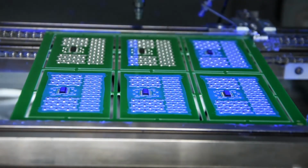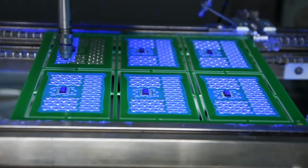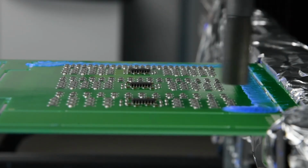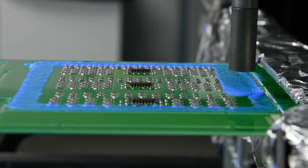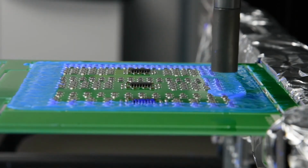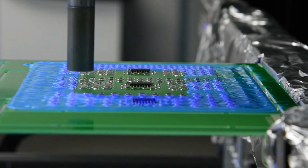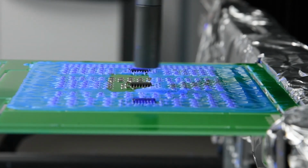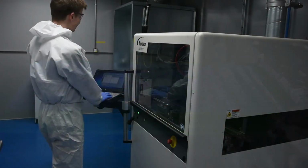The three major components of the coating process are the substrate, the fluid used for coating, and the coating machine itself. All three of the above must be considered to avoid potential problems in the process. Other points to consider are the applicator coating height, coating speed to avoid splashing or missing bits, and cycle time. It is also important to pre-plan which areas of the board require coating, which areas do not, and which areas don't matter.